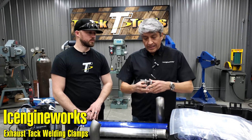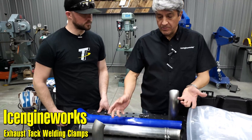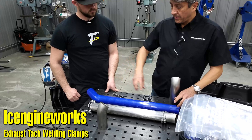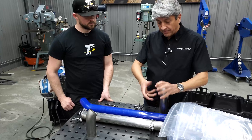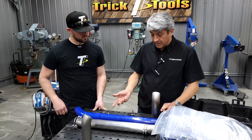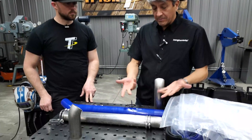The whole idea with the clamps is to be able to hold more than two sections — more than we can hold in each hand — and ideally prepare the entire assembly in one piece so you can present it and then just make the tweaks, the little minute changes to adjust angles and rotation. That's really the benefit of these things, and then the fact that you can come in and tack them without having to burn your fingers.